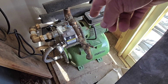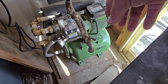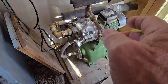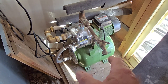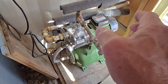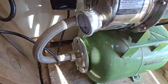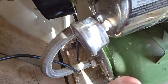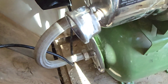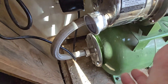Leave the valve open while you're checking and adding pressure — that will force any remaining water inside the unit out through the faucet. Put a bucket there and catch that water; don't waste it. Once you've got it up to 25 PSI in the empty state before it has water in it — that's important, because if you put water in there you're not going to get a proper reading, and your pressure gauge will never read correctly. Also, after installation, cut off that little nub right on top — just the little nub, not the whole rubber unit — and that has to be at the top. Your pump has to be level.